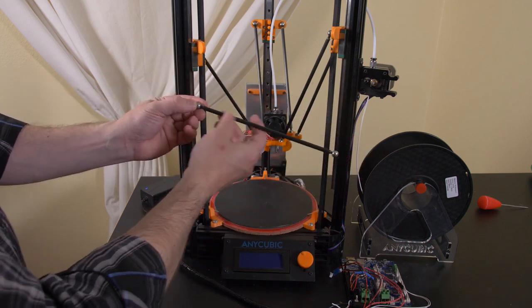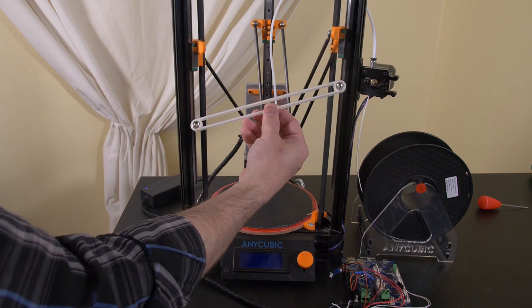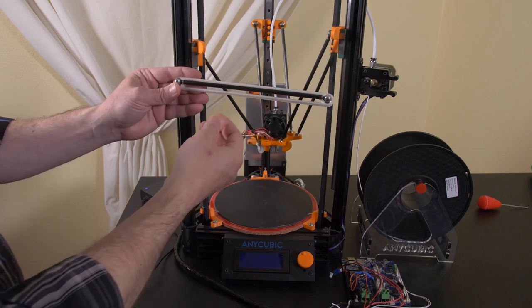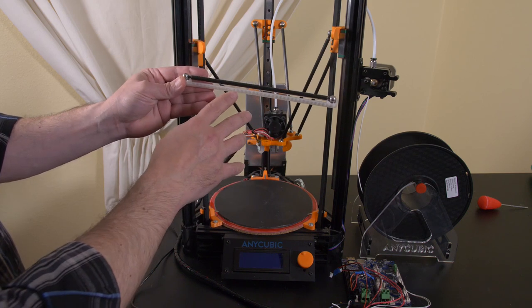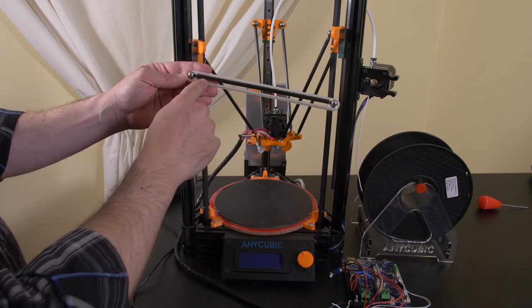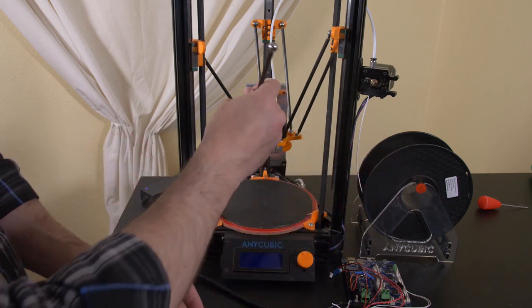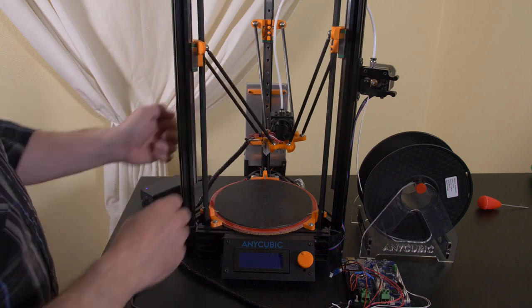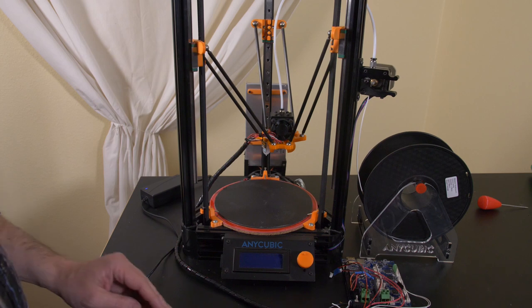but you're going to need a way to precisely locate where the ball bearings sit. So to that end, I've made this jig and it's pretty basic. Now, I set this jig to be 218 millimeters in CAD, but PETG shrinks a little bit. That means that my rods center to center on the pivot points actually measure 217.1 millimeters after it's all said and done. But what's critical here is that all of the rods are matching. So that is the case, and that means that as long as I know the length and they all match perfectly, everything should work quite well.